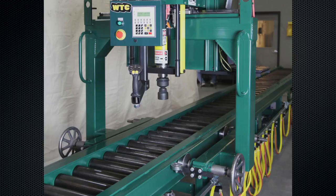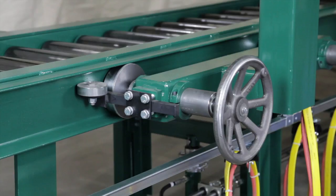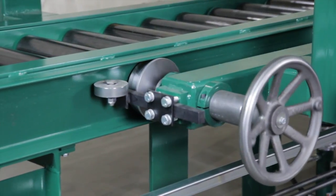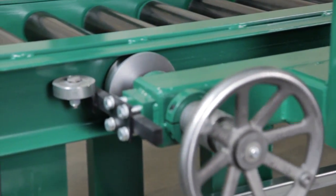Guide the wrench to a place above the conveyor system's outer rails. Measure the distance between the inside flanges on the wrench carriage wheels and compare this with the width of the conveyor system's outer rails. Loosen the wheel clamps and adjust the carriage wheels in or out to match the width of the outer rails, then tighten the wheel clamps when done. Adjust the four carriage outriggers so they touch the faces of the wrench carriage rails, and readjust the outriggers to allow the torque wrench to move freely. Carefully move the wrench along the length of the conveyor system and remove any obstructions that prevent the wrench from traveling freely.